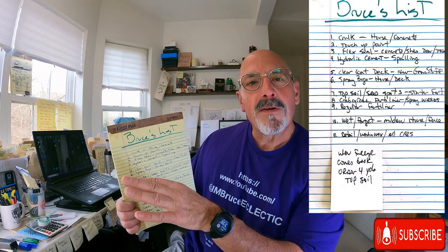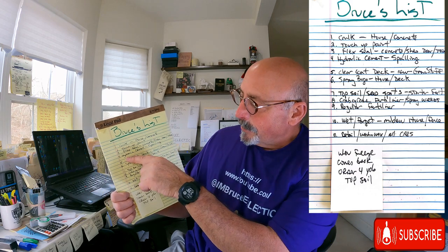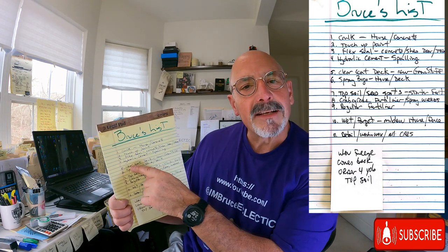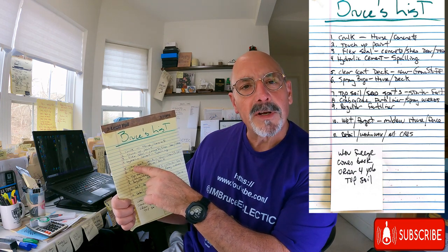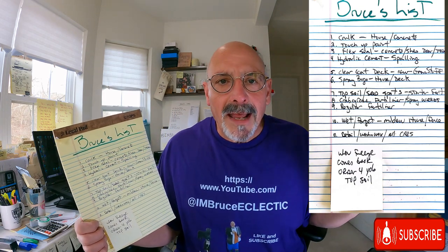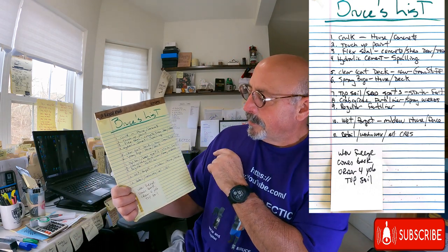So there's one spot that I didn't Flex Seal last year around my pool deck, away from the edge of the pool. I like Flex Seal, so I'm going to use some Flex Seal on it. I'm going to use the hydraulic cement on the spalling. And then I just rebuilt my deck last year, and so it'll be dried out sometime in the spring. I'm going to put a clear preservative. I like Thompson's, but I'm not going to use Thompson's. They have more magical products now that cost more money, but they last for several years. Thompson's is a 1-year product. I'm going to get it coated with a good clear.